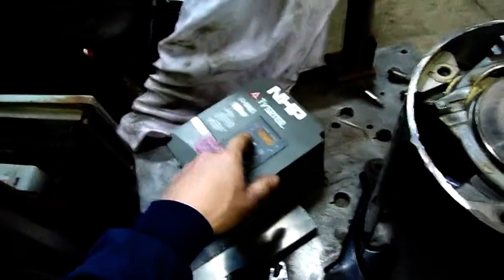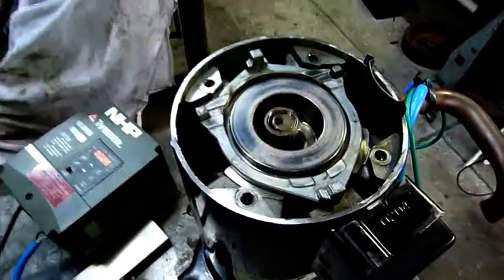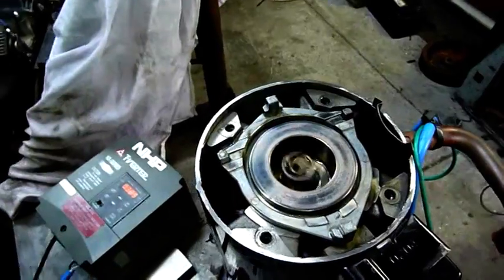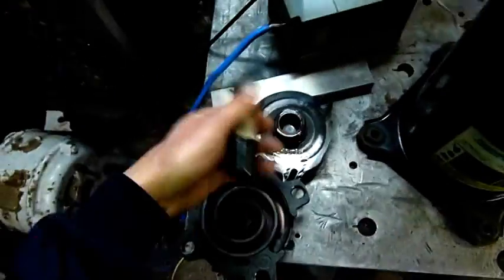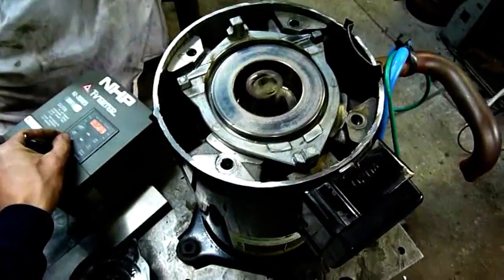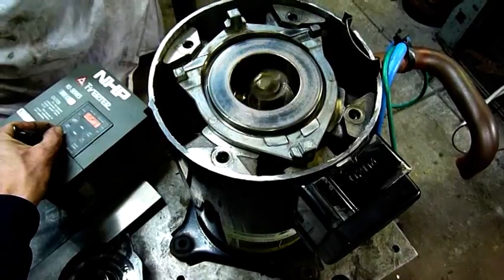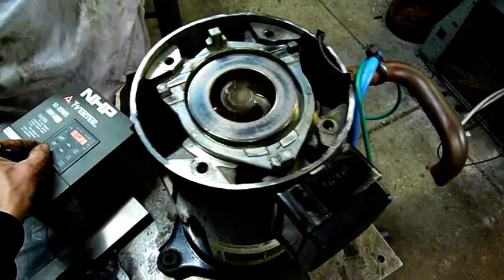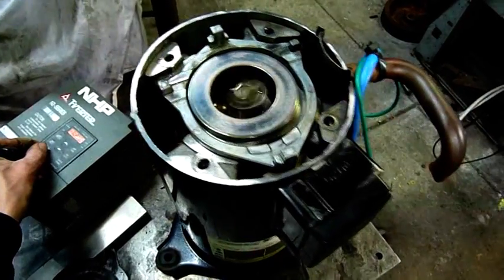I'll commence rotation of the rotor shaft. I'm not going to crank this up any harder because the entire assembly is balanced together as one assembly, and running it without any of this moving mass on it will make the compressor try to jump off the table — which I'll show you right here. So even at very minimal revs the whole thing tries to jump off the table.